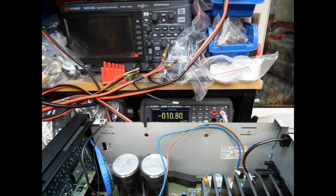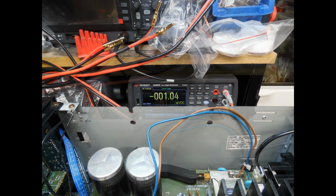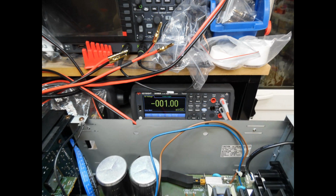And then here, what you can see is that the DC offset was quite high on one of the channels. When we measured this on the left hand channel, it was about 10.8 millivolts. After the adjustment, you can see that it's really low, just above 1 millivolt, which is perfect. I'm not showing the pre, but this is after, where the other channel as well is down to just under -1 millivolts. Fantastic in terms of eliminating any DC offset for the amp.